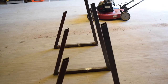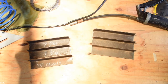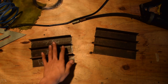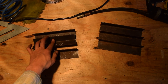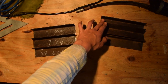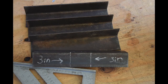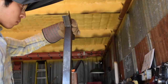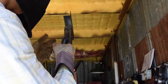Then I cut out these pieces of angle iron — the bed frames. They were seven by three quarters of an inch, and you're gonna want six of those. There's five and six. You're gonna want to measure three inches in from both sides, and that should give you your center. Here I am welding them on there.